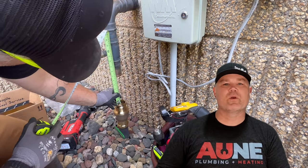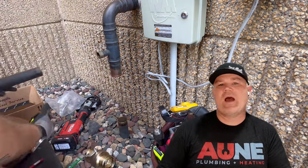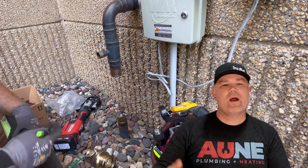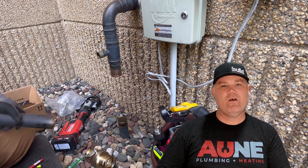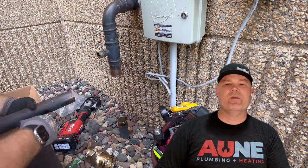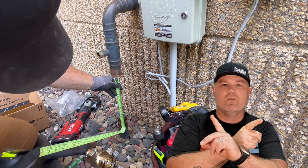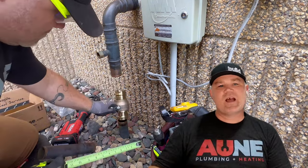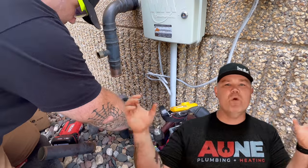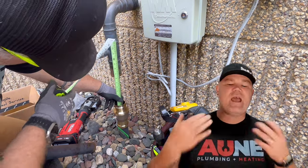I'm just going to reuse the old copper — there's nothing wrong with it. It's just a very short chunk of two-inch copper, which I don't have laying around in any scrap or leftovers in my shop. I had to cut out enough to accommodate for the valve and another fitting, which is a slip coupling. The coupling I'm going to be using doesn't actually have a stop in the middle of it — it just allows the pipe to go all the way through. No stop on the coupling allows me to put this together when I have two pieces of pipe that don't move very much and I don't have enough spacing to get the pipe, fittings, and valve together.